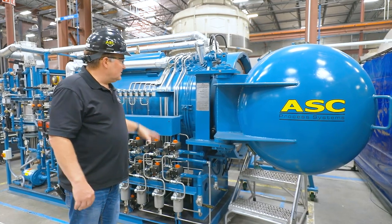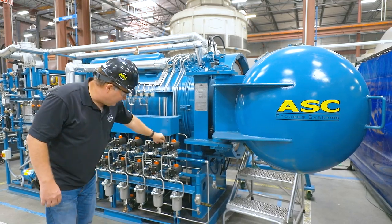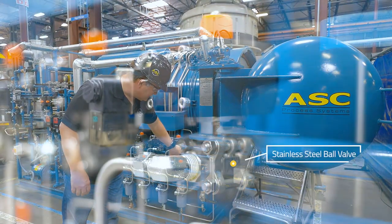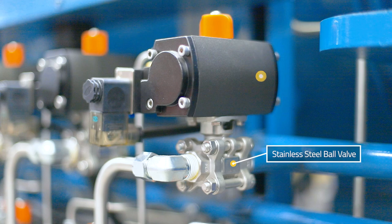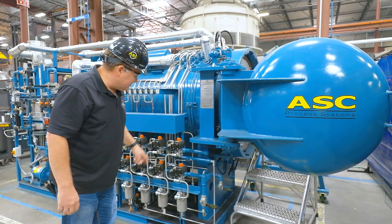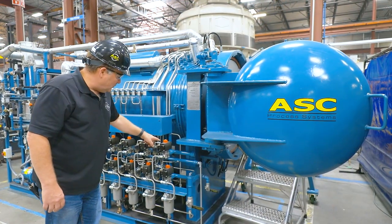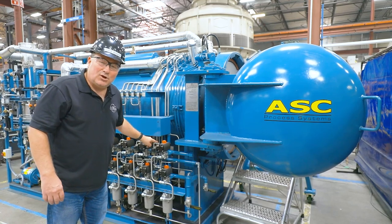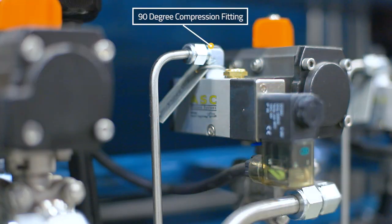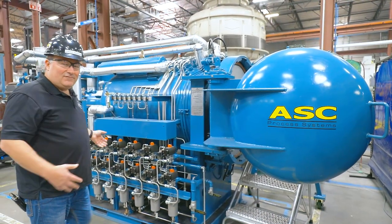Autoclaves have a lot of tubing used for the vacuum systems, but we also use tubing for the pneumatic lines connecting to all the pneumatic devices. For example, this is a stainless steel ball valve, and this unit on top is a pneumatic actuator — it takes air pressure and basically opens and closes the valve. This is a quarter-inch pneumatic line, stainless steel, and what we typically use are what are called compression fittings. You're going to learn all the different ways of using compression fittings — this is a 90-degree compression fitting, and this is a T down here — so that's part of the vacuum system.